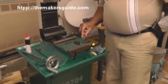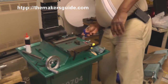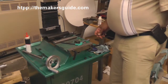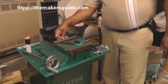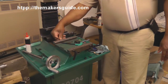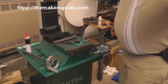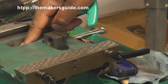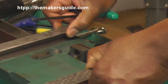The only thing holding this in place is this lead screw nut, which we should be able to get at now from the back. It's got two set screws. After a bit of messing around, it turns out it is actually a five millimeter bolt — it's just really tight. You just have to loosen these enough for that to happen. You can see that the nut dropped down into the slot, just held in by these two set screws. Now you can slide it out.